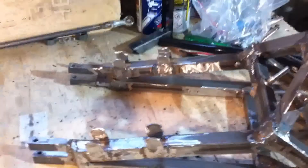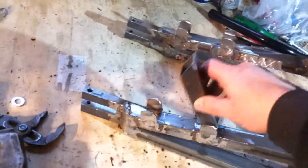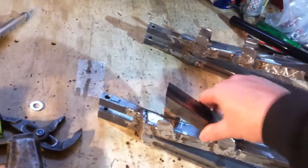I've been finishing off the bottom end of the frame, which when the unicycle is running is in this kind of position. I've welded some brackets on here and here each side, so if I want to mount something extra like a detachable footrest or some kind of anti-tip safety device, these are quite handy. There'll be bolt holes through here and various things can mount on, be removed if they don't work, and modified.